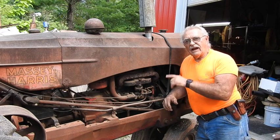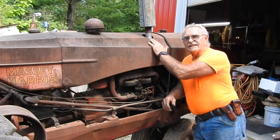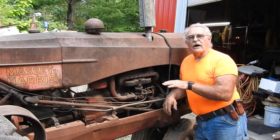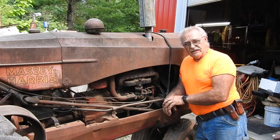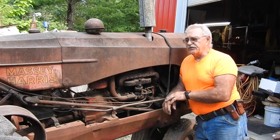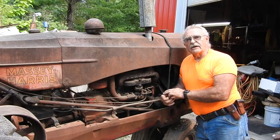After a little more investigating, I had a hole in the roof that dripped perfectly dead center down the smoke pipe, and two cylinders were holding like an inch and a half of water on top of the pistons. The others had drained, but this thing was a total mess. I had to totally rebuild it - pulled it apart, took it to the machine shop and had them bore it at least 20 thousandths over to get rid of all the pits.